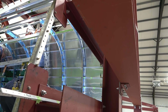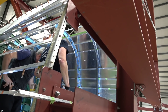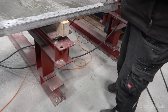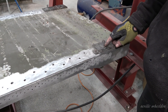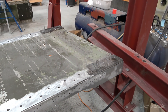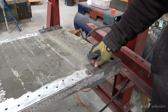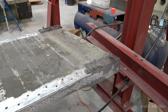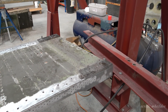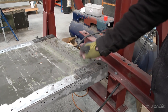All the skins, formers and fittings will be pinned in place before any parts are riveted together. They will then be taken apart, scuffed down, painted and reassembled. See the shoulder on one side — on the steel plate — and you've got a steel plate this side. So it's got to be flipped over and pressed out, because there's no way you'd ever knock that out; all you'd do is damage the pin. As they haven't got a press at the moment, they're buying one — Andrew's bought one as far as we know. Hopefully we should have that in the next few days and be able to press them out, get the screws out and get that plate off.